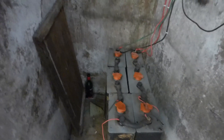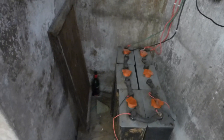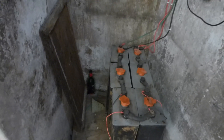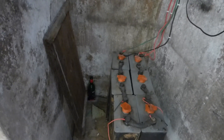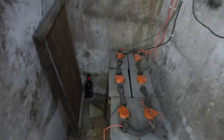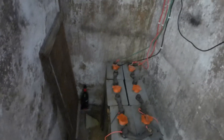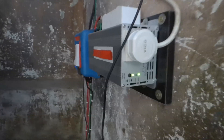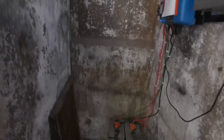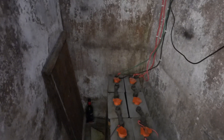When we opened some of them you could see the white stuff — solid, powdery-looking — that's what sulfation looks like. We put distilled water in them; we got the distilled water from air conditioning units. We've been charging them gradually every day. The exciting part is that the people I've connected are running — as you can see the inverter is on right now, the green light is on — and there is power at night.